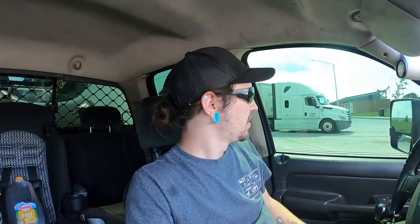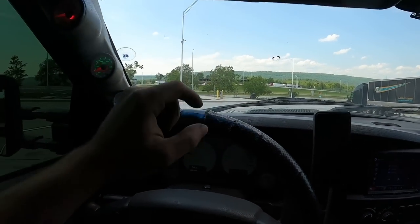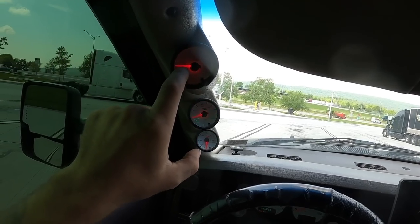I'm gonna get rolling. We have about two hours until our drop-off and I should be able to drive that completely. Being that this is a local run, I'm not using a single thing of fuel, which is awesome — just running the truck on waste oil now, completely for the last little over 2,000 miles. No issues there. Ever since I switched over to the oil filters, everything has been great. The only issue I ever had with the waste oil was clogging filters, and now that I'm running 24-micron oil filters, problems have been absolutely none. Since I gutted the fuel filter up front, we actually have pretty good fuel pressure — 36 PSI out of a stock pump. Pretty good.